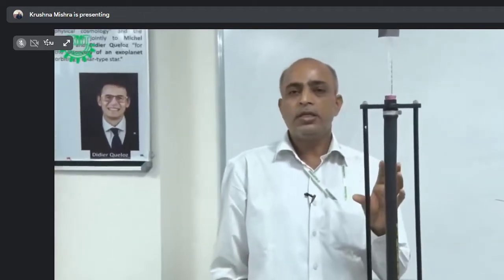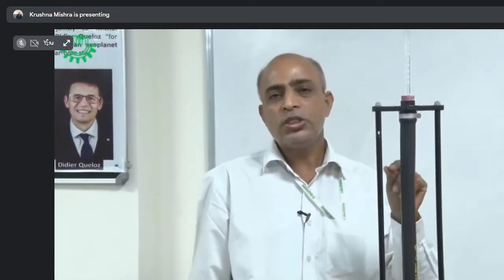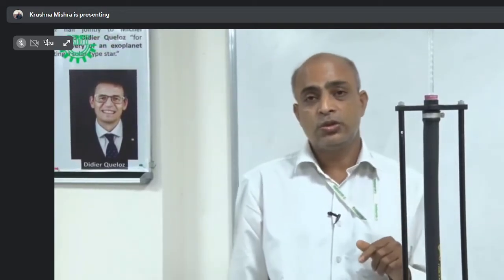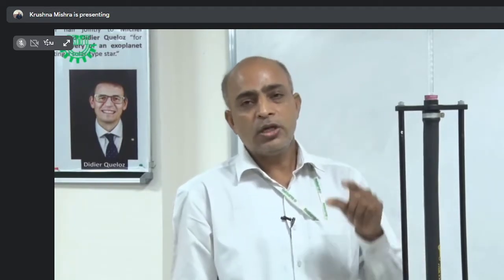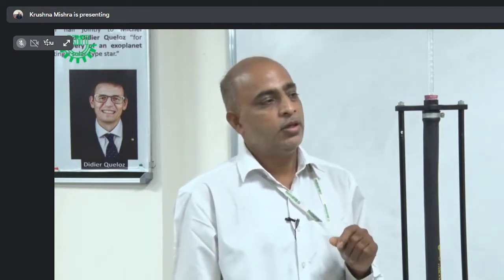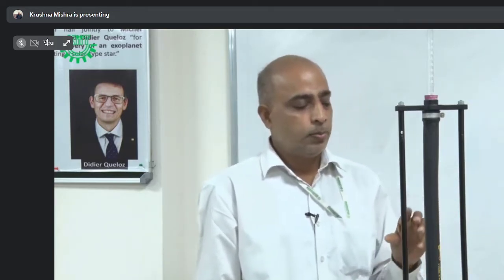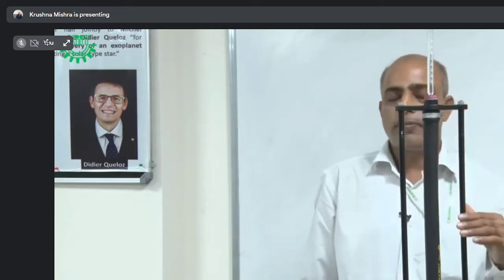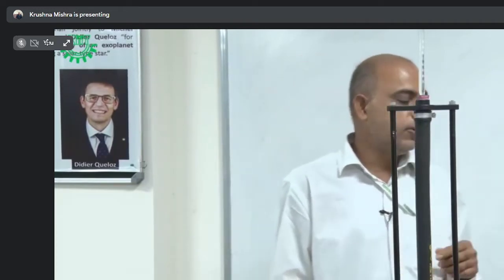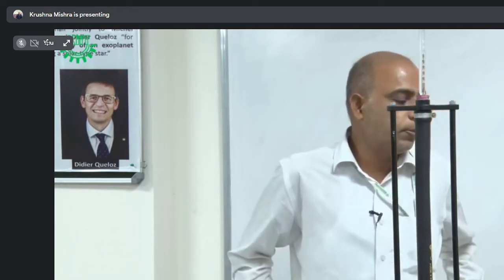The aim of the experiment is Poisson's ratio of a rubber. Poisson's ratio is an elastic constant, which is the ratio of lateral strain to longitudinal strain within elastic limit. So we will do this experiment within elastic limit. Beyond that, it will give a permanent deformation.